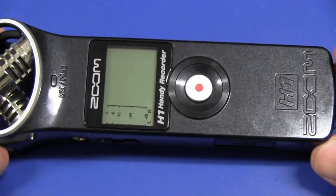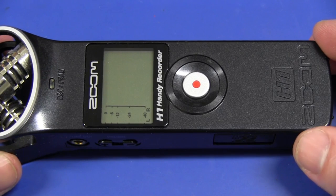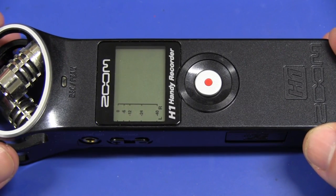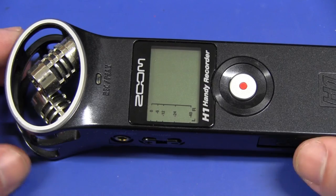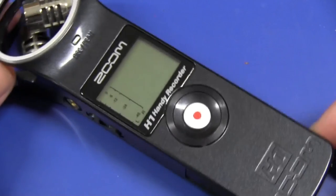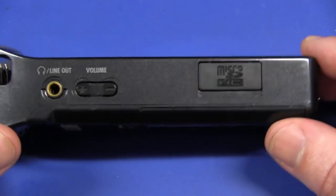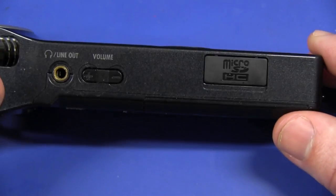So let's open up this thing and see what's inside. I expect a microprocessor - I don't know what type. It'll probably have MP3 encoding capability, maybe there's a separate MP3 encoder chip or maybe it's built into the main micro, and there'll be an analog-to-digital converter as well. That'll be a 24-bit type, because this thing's capable of a 24-bit ADC up to 96 kilohertz sample rate - pretty high-end stuff. I expect there to be some shielding in there. So there'll be some ADC, a micro, maybe an MP3 encoder, and some analog input circuitry.